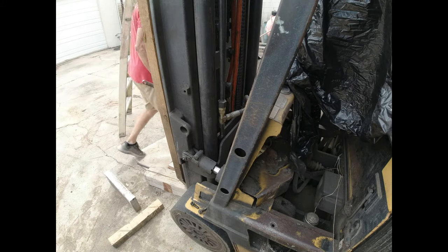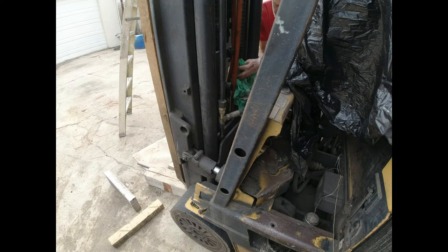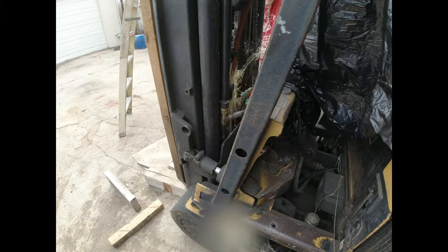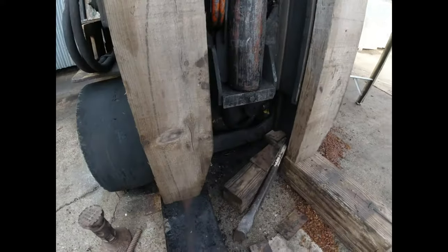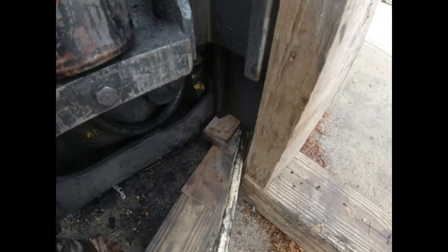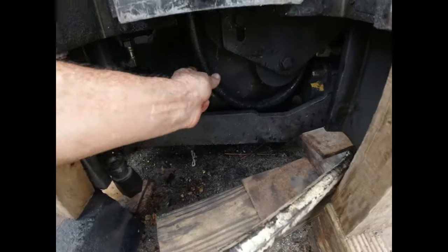I didn't know why the hose wouldn't reach until I figured out that the inner-inner part had dropped. Picking it up was a trick because it was two inches from the ground and I couldn't get any lifting device under it. I ended up using a crowbar, lots of metal shims, and a little screw jack - picking it up a quarter inch at a time and shimming, back and forth. There's not enough room in there to get my jack so I've got a crowbar and a pile of dunnage. Every inch I pry it up, the hose gets two inches more slack because it's a two-to-one deal.